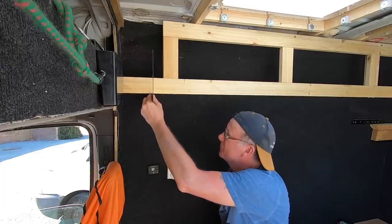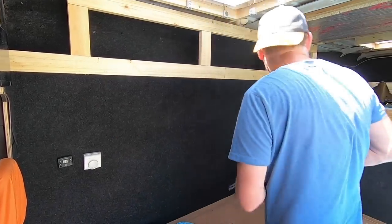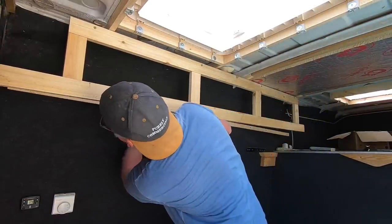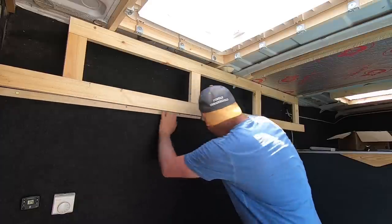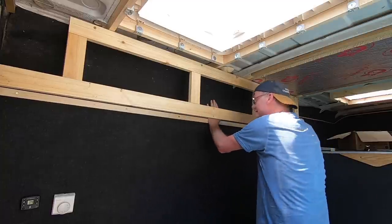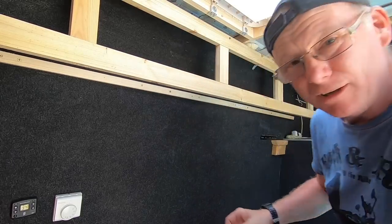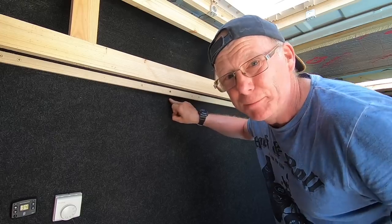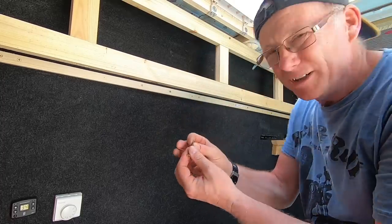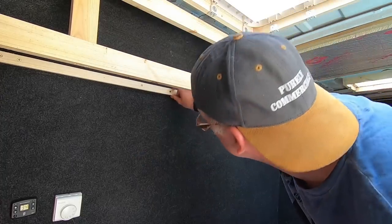It's very difficult to see the mark because it's black - same down the other end. I've cut my batten to length and all I've got to do is offer it up here and look for my little marks. I've ended up using really long screws - I figured out where the ribs are and screwed through the batten and into the ribs on the other side of the board. This makes it much much stronger rather than just screwing into the board. I can guess where the ribs are by going by the ribs in the roof.